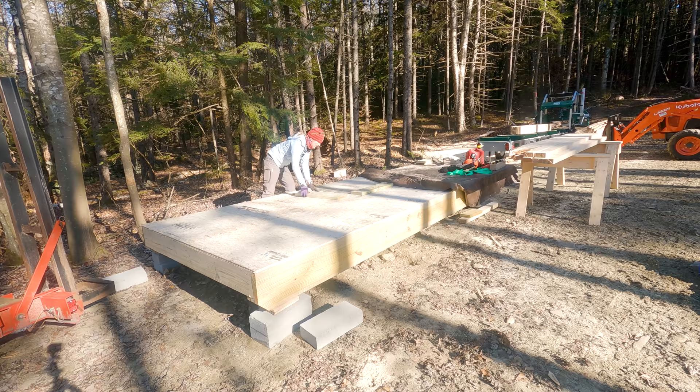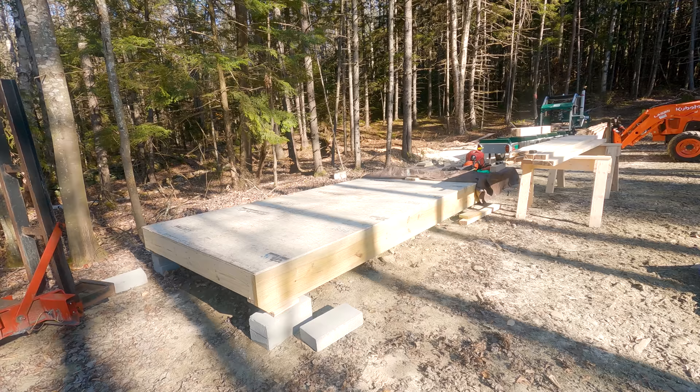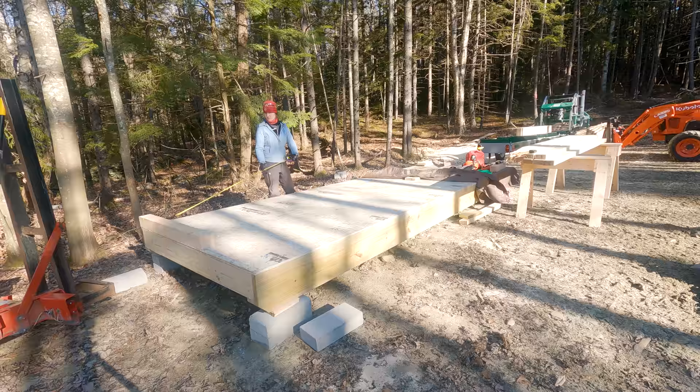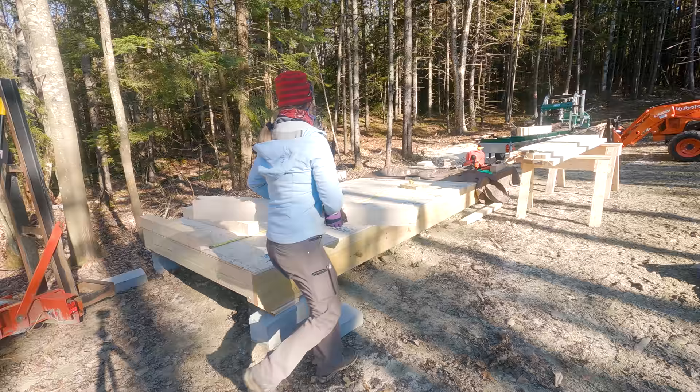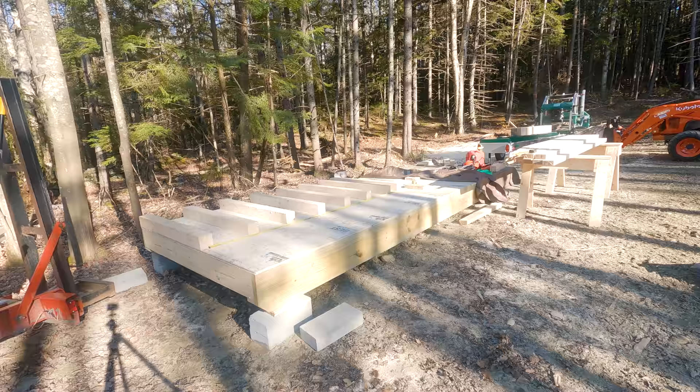It's so satisfying as you start cutting down and the pieces go from being rough-edged pieces of a tree into actual two by fours with smooth four sides — it's really, really nice. Here we're laying out where we want to stack the boards. It's really important that the boards are stacked carefully; we milled our cants and stickers to let us do this. We're going to use the base of the solar kiln that we've been building since we're not expecting to frame it this year — it was getting too cold and we were heading south soon — so we decided to use this perfectly flat base as the perfect place to store all of our milled lumber.